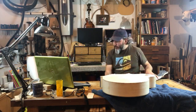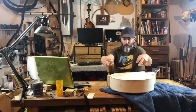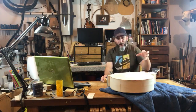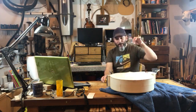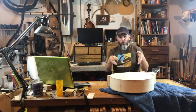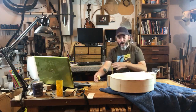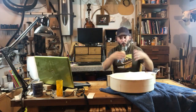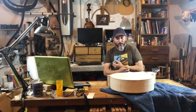Yeah, Ronnie's saying that tap tuning a top is harder because it's not just two tone bars, and I can totally relate. It's really, really hard to isolate a certain group and then hit it, because whenever I hit even the backboard, which had no tone bars and was handheld, sometimes I was hearing the actual plate, sometimes the overtone. So you kind of have to target the one you think is the proper one, and then go from there and adjust. When you adjust one, it changes the tonality or the actual resonant frequency for the whole plate. As soon as you remove wood somewhere, it changes at the other end. So with all those braces on a guitar top, it is really, really hard.